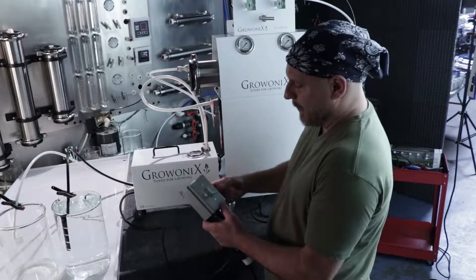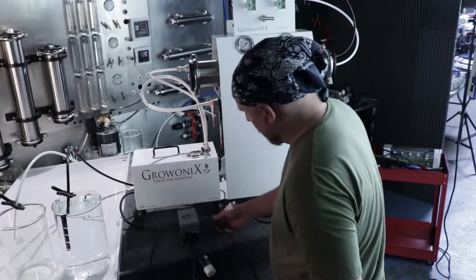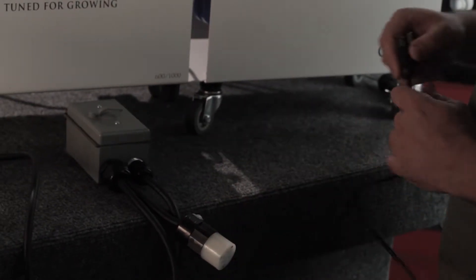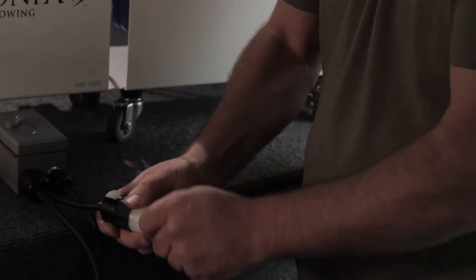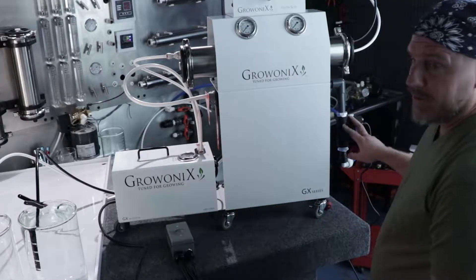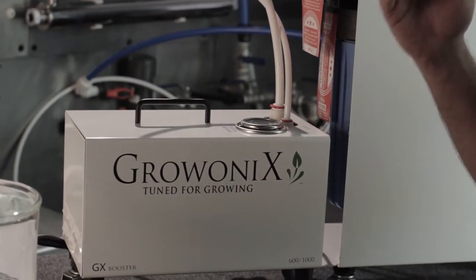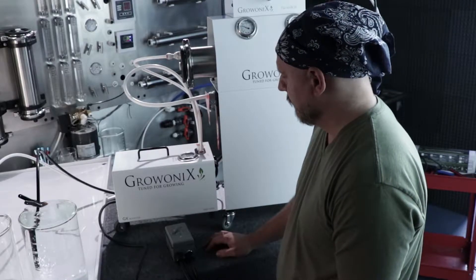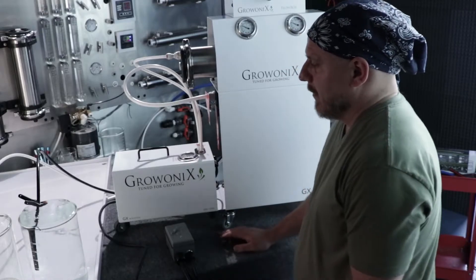On a BP6010 pump there is an on-off switch — we're going to keep it in the off position. The mains power cord is here, and we're going to plug it into 120 volts. The little piggyback cord here is for the solenoid valve, so we plug the solenoid valve into it. What this does is: when this switch is turned on, the piggyback cord is energized and it will open the solenoid valve, allowing water to flow into the water filter. The pressure switch will turn on, and the RO will turn on. Here we go — so now we're running.